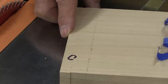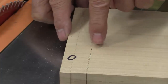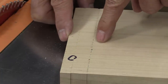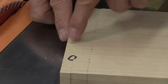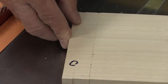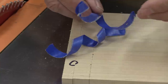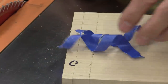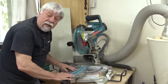There's the difference. I've cut right through my one mark — there's with tape and there's without tape. Actually in this case you're getting a cleaner cut without tape than with tape. So this whole tape-on-top-of-the-wood idea on a table saw is just a myth.